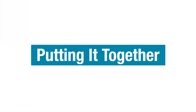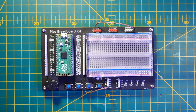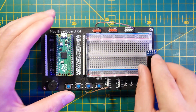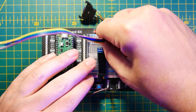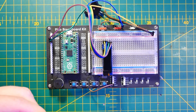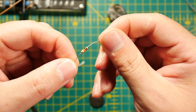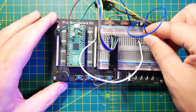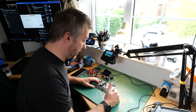But that's actually just on paper. Let's build a test project and see if I can make it successful. I have a small Raspberry Pi Pico board extension kit, which is very handy for prototyping. It will break out all the necessary pins so you can take advantage of the breadboard attached to it and start connecting components. I'm going to start with my OLED display, which uses 4 wires and connects to the I2C created on GPIO2 and GPIO3. Another thing I have to connect is a pin to monitor or measure the voltage of my battery, which in this case is connected to GPIO28. To prevent the pin from floating, I also have to pull it to ground, so I'll add a small 10K resistor to it. Lastly, I hook up the power using Vsys and ground to power up my Raspberry Pi Pico.